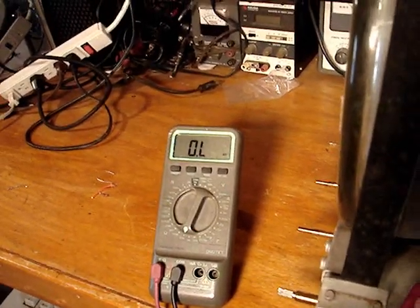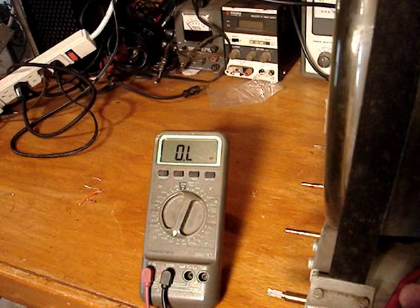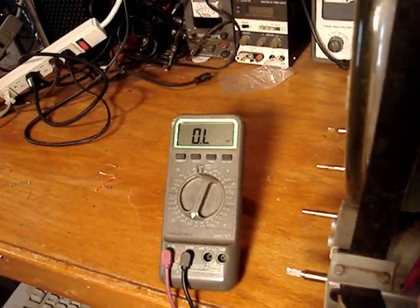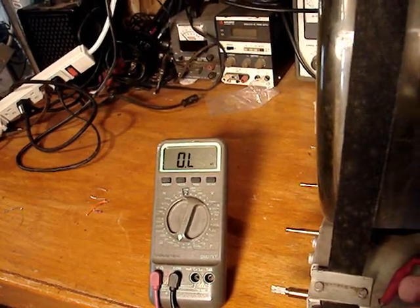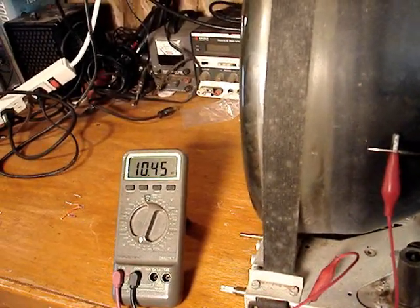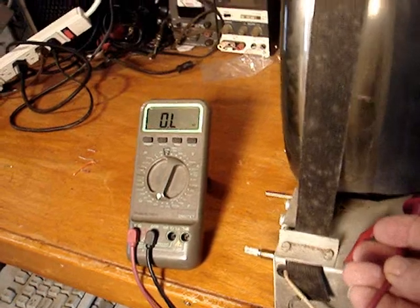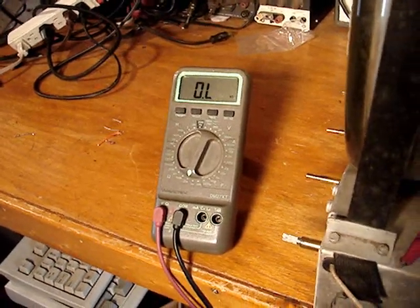I have a couple of choices. I could take the CRT out and fix that connection, but I've got this thing all lined up now and I'm really hesitant to do that. I know that other people who are probably more detail oriented than I am would probably do that. I do know the AquaDag does conduct, because if I put my probes on the tube, it is conducting. However, there is no connection to ground, and that's important — it has to be there to filter those high voltage pulses so that you don't get interference on the screen.